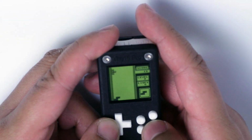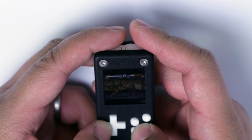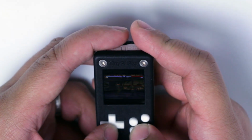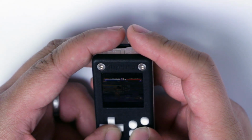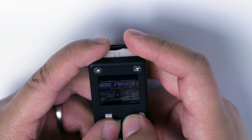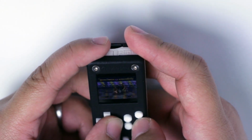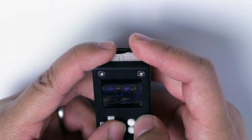The main gripe I have with the TinyPi Pro is that there's no hard power switch. On some occasions the device would just be frozen to a blank screen. I thought it would eventually turn off, but it didn't. I thought holding the power button down for a long period of time would make it turn off, but it didn't. I either had to wait till the battery had run out or take the battery out of the device. I would have liked an option for a power switch in this situation, but hopefully I'm the only one that has seen this issue and it hasn't affected anyone else.